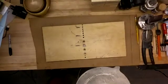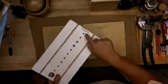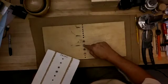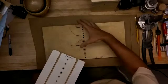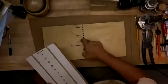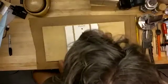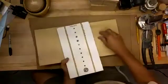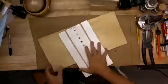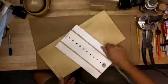Next up is what I call the swivel plate. And again, this has holes in it that allow me to position it on the bolt, just to accommodate the size of the bowl. I may want to bring this back, I may want to bring this forward, but these holes are just there for positioning. So I find a nice set of holes, drop it over the bolt, I put a nut on, and now I have this nice circle cutting jig that can hold something.